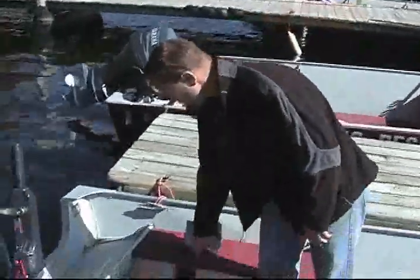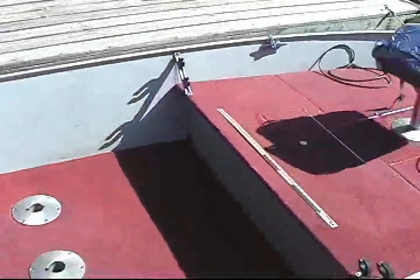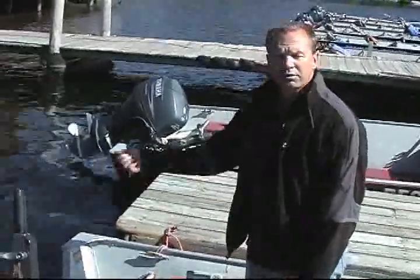We've got two switches over here for your bilge — turning it on will bail out any water that might have come into the boat. You also have your aerator switch, which will fill up the live well up front. The aerator draws from the back of the boat, so when you're running the boat down the lake, it's a good idea to turn the aerator off, or else it'll run dry.